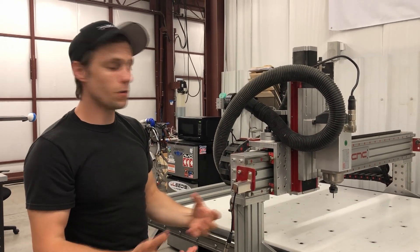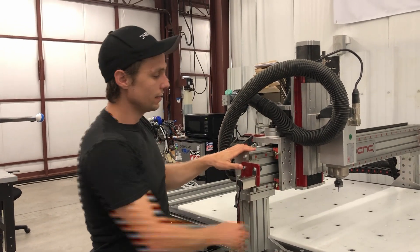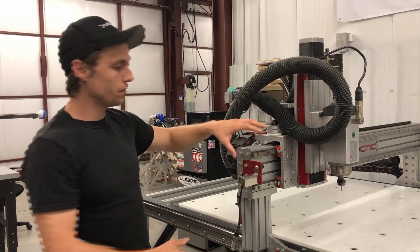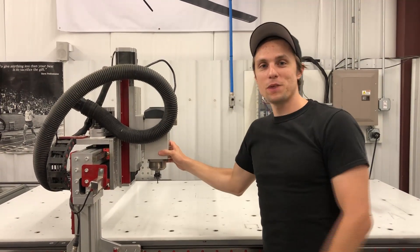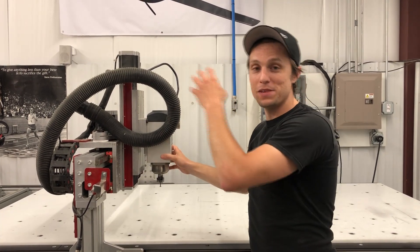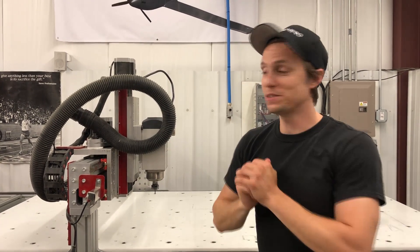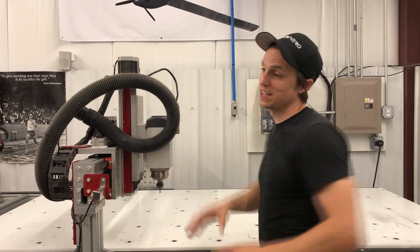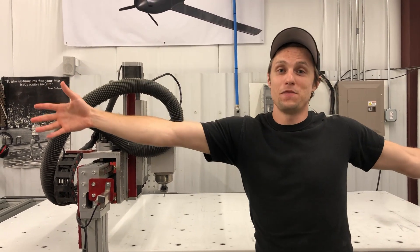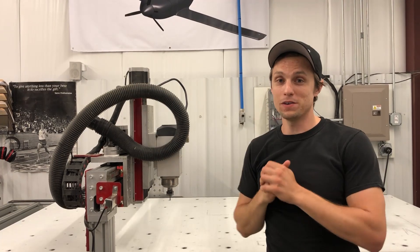The last upgrade was choosing the 8-inch Z-travel option instead of 12 inches. The higher the spindle sits on the gantry, the more relative motion and less rigidity you have. The closer you are to the table, the more rigidity and accuracy you achieve. We prioritized accuracy over machine volume, so we opted for the lesser travel. Stay tuned for part two, where we'll cover making the mold patterns themselves — including how to machine a large pattern from smaller sections.